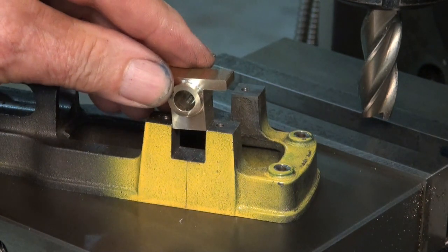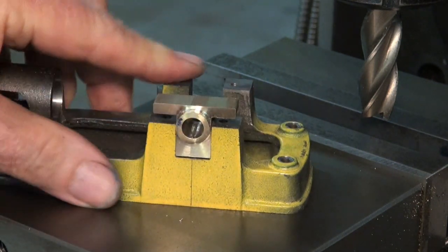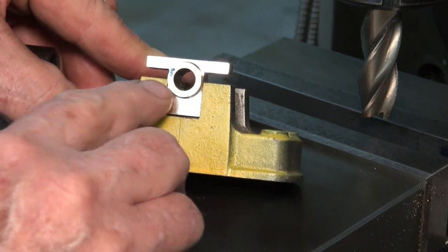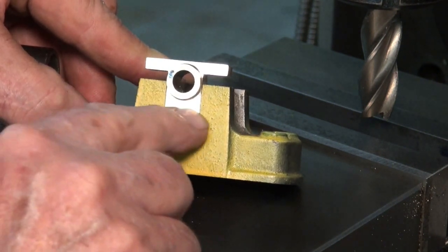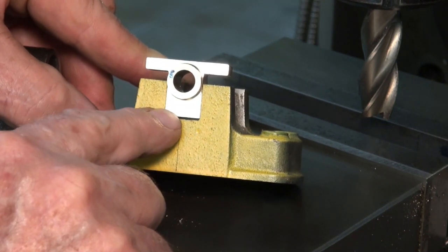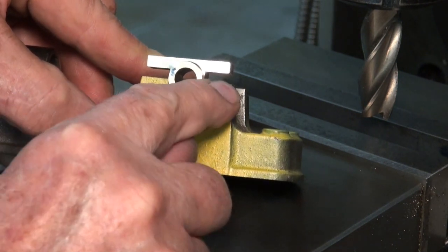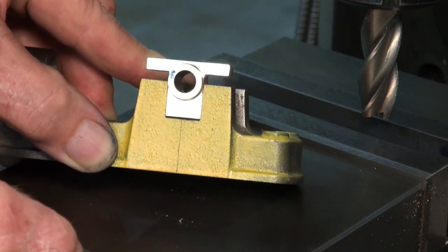These bearing brasses are designed to fit into this 1/2 inch wide slot, but as it's supplied it's a little bit oversized, and I'm not sure, but it could be that makers were given the option of actually producing a split bearing. The drawings don't show that. The drawing just shows a one-piece bearing, so that's how I'm going to machine these. So what has to happen now is we need to machine the total height of the bearing down until it fits into the hole of the bearing housing, with the top plate touching the top surface of the bearing mount.